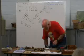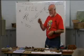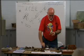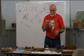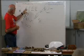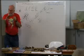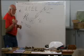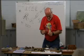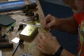So just very quickly, the other way to get a grace line, I can either use the onglet and just tilt it over a bit like the ice skater going around corners, or else I can use a slightly broader tool like the square, for example. You can see how this is a much finer blade here, whereas the square is literally at right angles. I can go in with the square and do the same thing. Yes, that's nice and sharp. So now I'll cut a grace line down using the square.